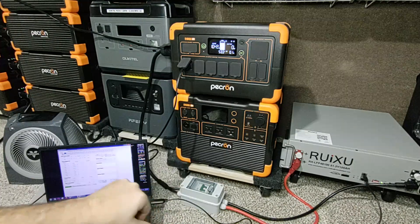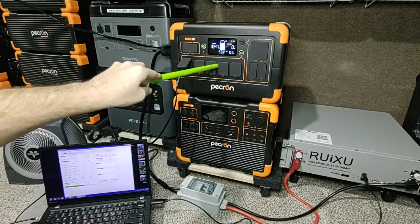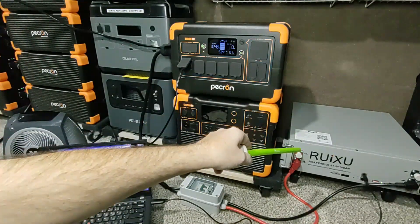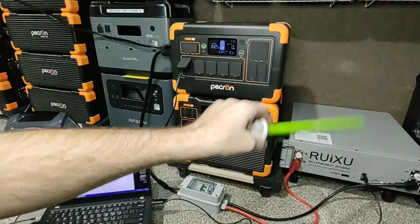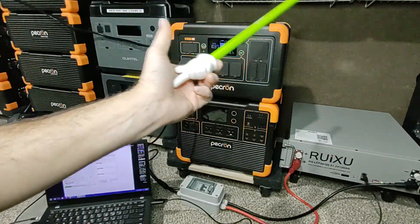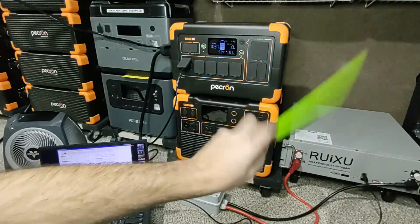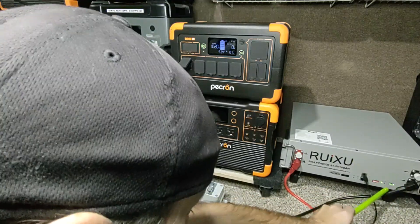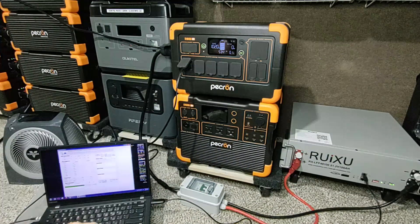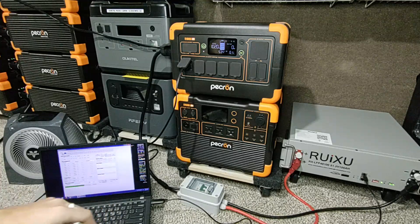Here's why I wanted to do this: I don't need a lot of power for my workshop, and this would make a great backup 'gas tank' style system. Imagine having two, three, four, five, or ten of these server rack batteries on a bus bar — it would take a long time to charge 30,000 watt-hours at 1800 watts, but as a backup tank it's really cool. The key requirement is they must all be the same voltage. You cannot put a 24-volt battery into a 48-volt system — not safe.